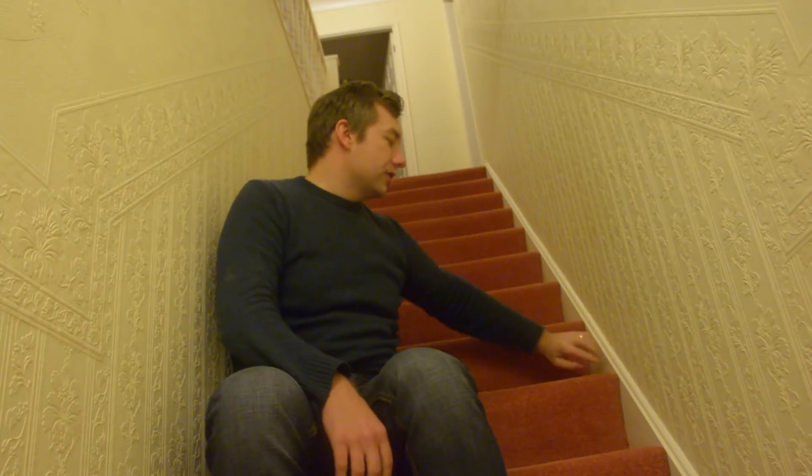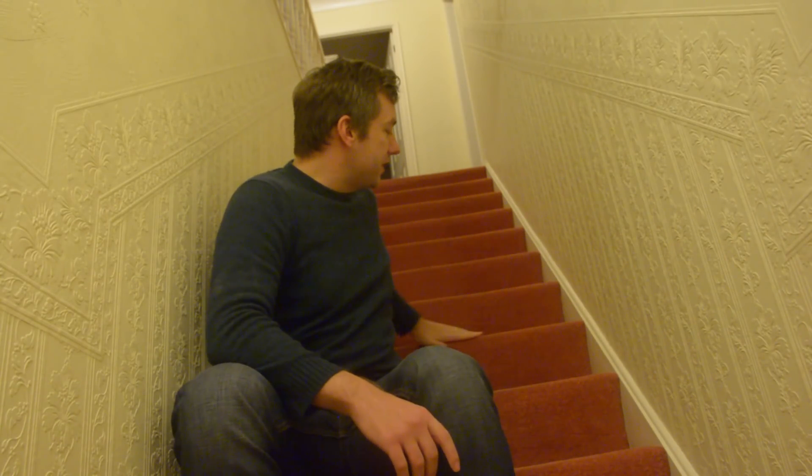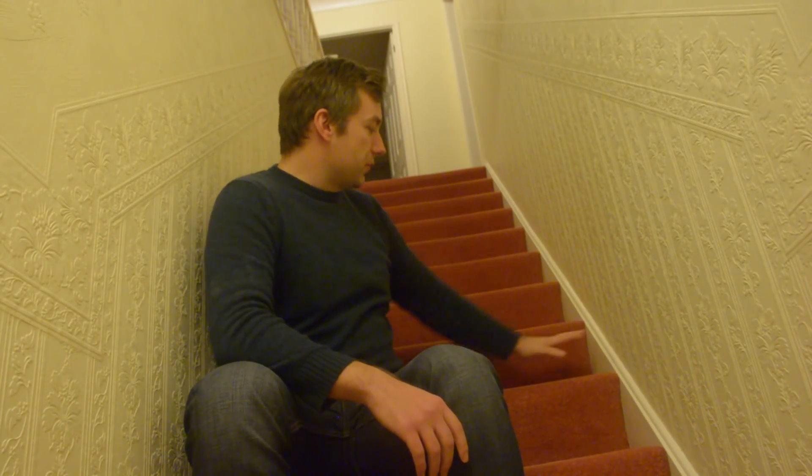So I was thinking maybe we should add LED lights on this wall. Why this wall? Because there is a power socket at the bottom which I could use, and then we could run some sort of trunking along the skirting board to make it nice and nearly invisible. There would be one motion sensor at the top and one at the bottom to trigger the lights both ways, and I was thinking maybe add two LED lights for each step — one at the edge of the step and one halfway through — and that should provide enough illumination for every single step.